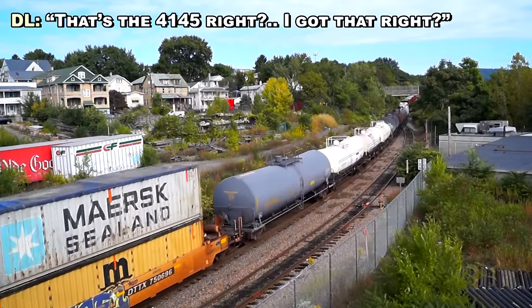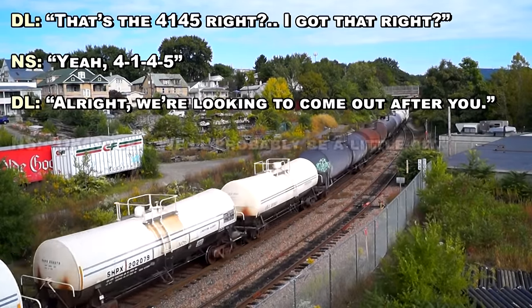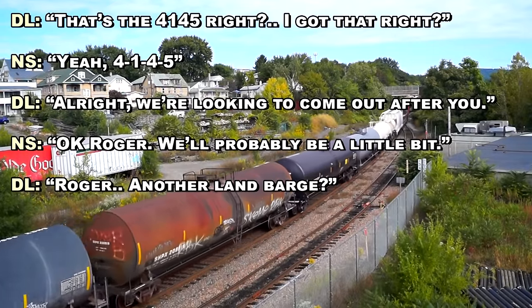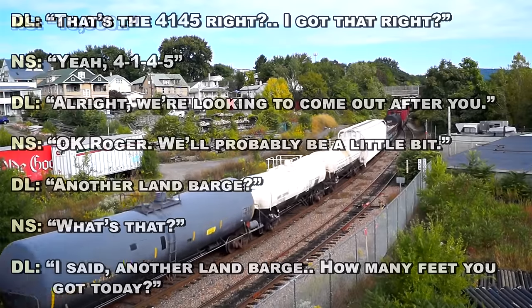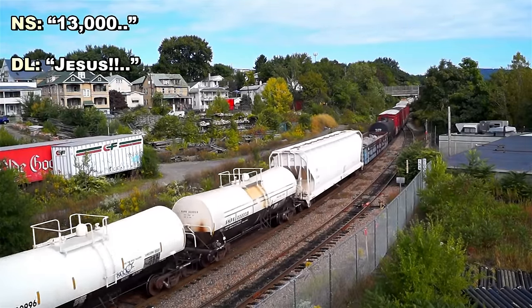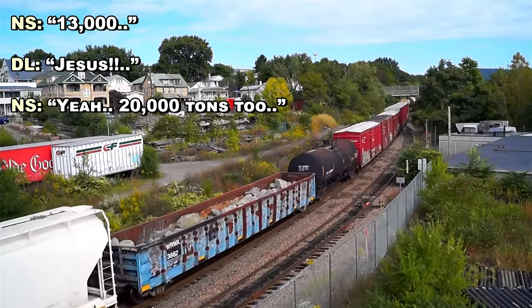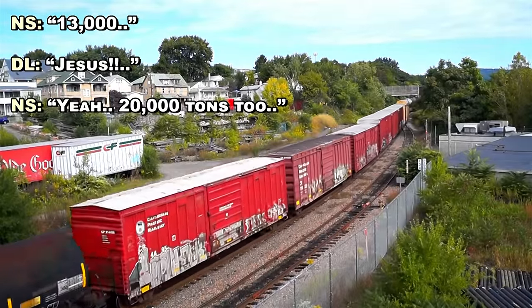Air is important, obviously, but mid-train DPs on long trains are still a pain in the rear end, as the air has to pump to the rear of the train as well as towards the head end, and the head end is still pumping towards the DPs. This means that your air will recharge quicker on the front half, but may still take quite a bit of time to fully build behind the mid-train units. Weather is also a factor, as I mentioned earlier. The colder it is, the harder to pump the air.